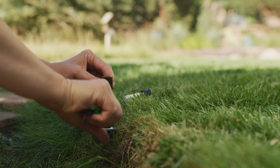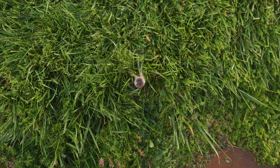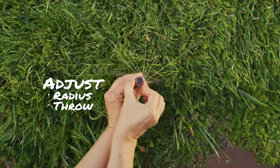To change the nozzles, pull up the sprinkler riser, unscrew the old nozzle, and screw on the new nozzle. Turn on the zone and adjust the spray pattern. Line up the left edge, adjust the radius, and adjust the throw.